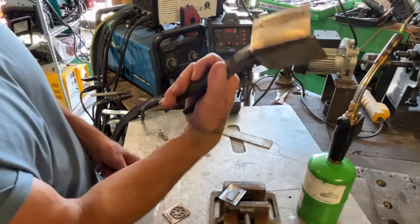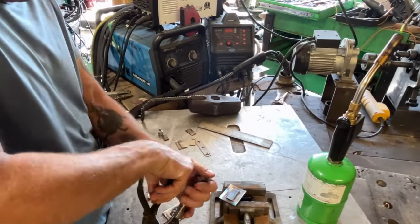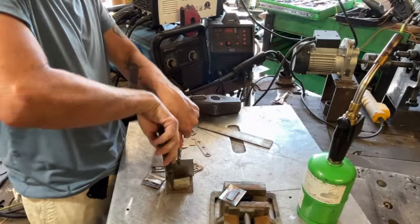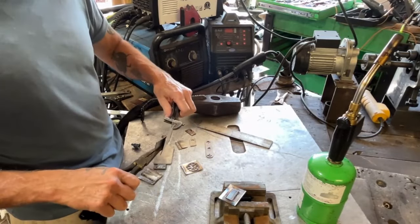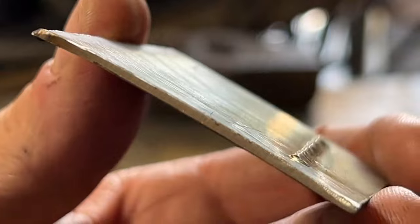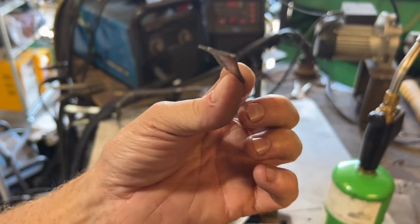This thing is totally adequate for that job, like the heat shroud I was doing. Should you weld exhaust tubes together with it? No — they're going to get hot and shrink and expand and contract and you're going to get metal fatigue breaks. There are some things you can't use this welder on, but I think it got a really bad rap online. Cold welders got a terrible rap. They're far faster than what I've shown in the video — you can turn the settings up. The welds are strong enough for most applications. If you break a weld like you see here, in a real-life situation the structure being subjected to those forces is going to be far more damaged than the weld. We're looking at 120 degrees of deflection — how many circumstances do we get into where we deflect metal that bad? The weld survived that test in my opinion and I'm sticking to that story.